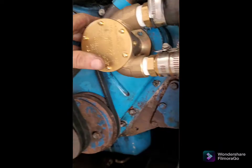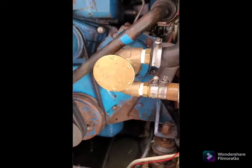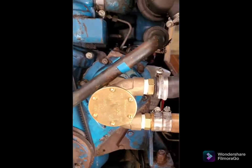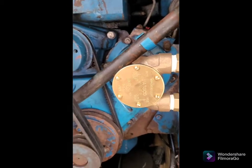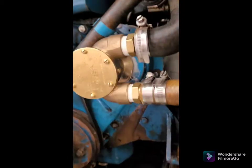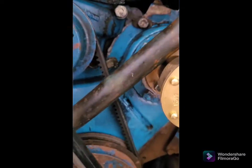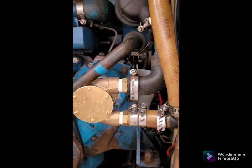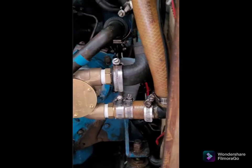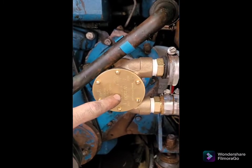We're going to slot our pump in — it's fitted in nicely — and now we'll put our nuts on. Tighten them fairly tight, allow it an hour, and then tweak it up by another half turn. Here she is — new pump installed. You can see that gasket goo, the gray stuff, beaded up around the adapter plate. We're going to wait an hour — those nuts are hand tight — and then we'll crank them in a little bit more. After 24 hours drying time we'll tweak up all of our hose clamps, pop the plate off, and lubricate the impeller before we give her a run.